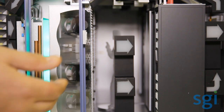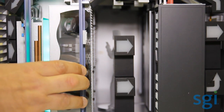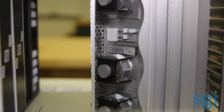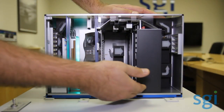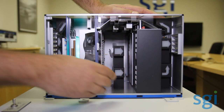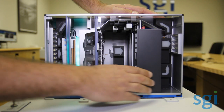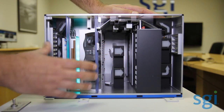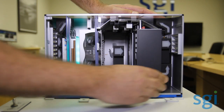In a typical scenario, the maximum wattage for each rack allowed in a four-rack unit is 35 kW. We can cool 35 kW per rack — times four, that's 140 kW. After the fans is the IT section, which is totally separate from the cooling section. SGI has the capability of delivering 35 kW per rack in four-post and roll-in cabinets. This cooling section can provide up to 140 kW of IT load. It doesn't matter if you have all that power in one rack or spread across all four racks — this cooling unit is designed for 140 kW of cooling.